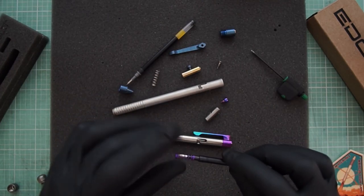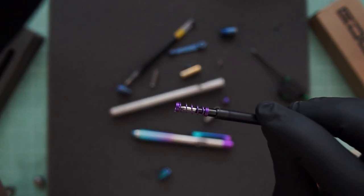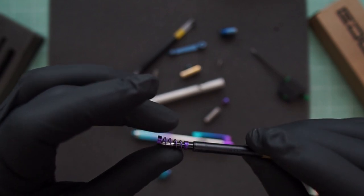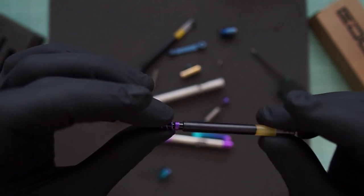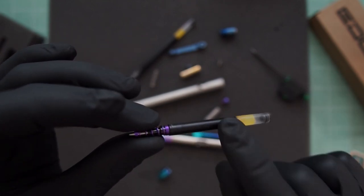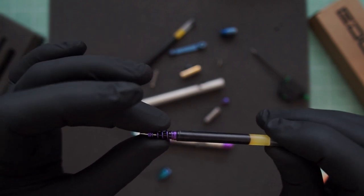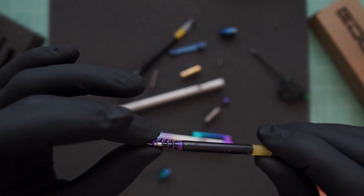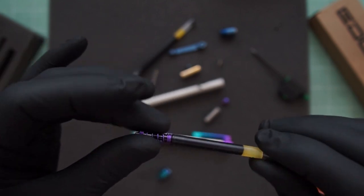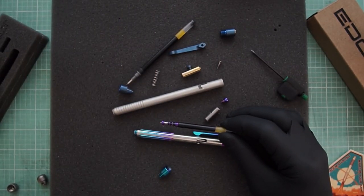So the springs — I love these little titanium springs I make now. This is a fairly tight fit, so to get this back on I just spin it to grip on the end of the refill. I find these refills are made to a pretty insane tolerance — some of the other ones have an ISO tolerance — and out of the hundreds and hundreds of refills I buy, they just fit really nice. They all come with titanium springs now because I can.